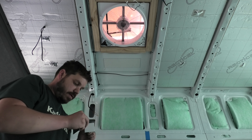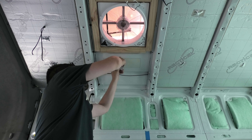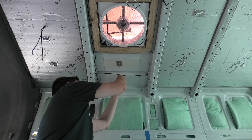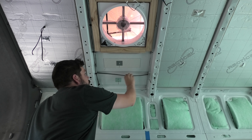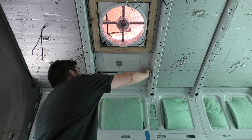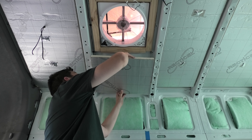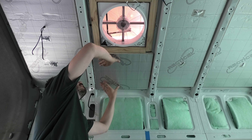Once you've attached the PIR board and put the clip on, there's going to be a sharp edge — these are just a wee bit too short. If you've got longer ones you can actually bend them over and just tape over, but because these are so short you can't bend them over. We're just going to cut the end off with some pliers to make a nice flush edge, and then get some aluminium tape and tape over the whole thing.